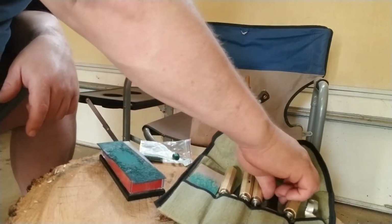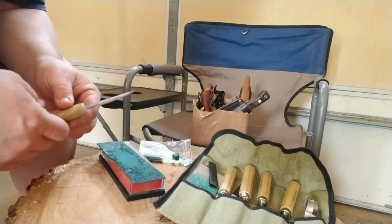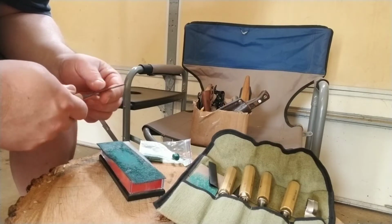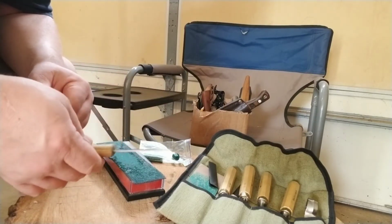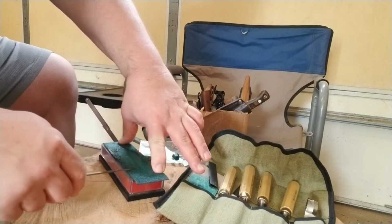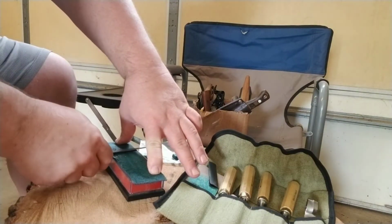I said we're going to be using the sloyd today, so we'll break that dude out. It comes razor sharp, really, really sharp. But before doing any carving with it, I like to strop it real good. So just find that angle, and you want to pull it away from the leather.